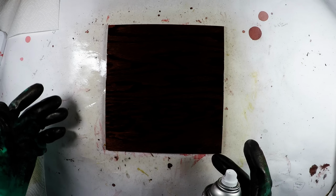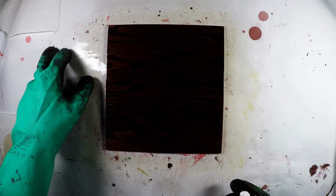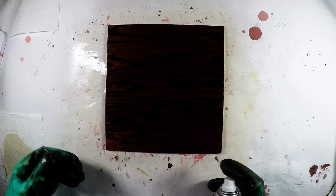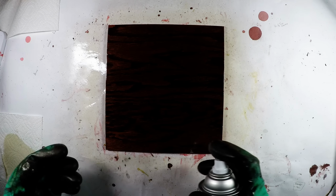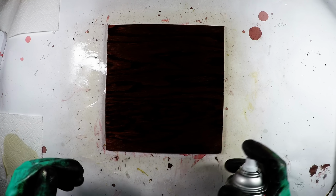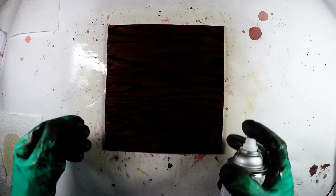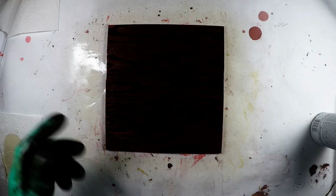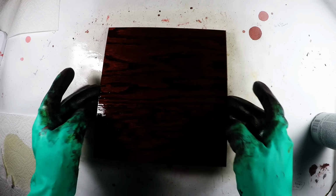And now it could also vary based on the wood, the type of color that you're going to end up getting. So say that if you wanted to go a little bit more to the orange, well, then you can go with like 16 drops of the yellow. You know, this is just kind of a generalized ratio. So, I mean, you can slightly modify some of these to get to a different color. So if you want a little bit more orange, add a little bit more yellow. If you want a little bit darker, then go with a little more black, or perhaps even a little more brown.